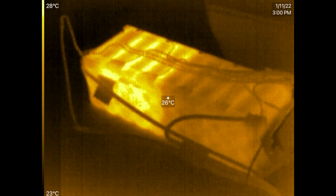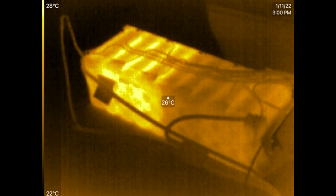You do this on the first try and then the second and third, and if the heat starts dissipating throughout the entire pack, then maybe it fixed itself. But if this continues to happen cycle after cycle, then you have a pack that might be compromised. So this is how you minimize the risk — you just don't keep charging it fully like this. Right now I'm pushing like five amps in there, which is quite a bit — that's probably about the max the BMS will allow. Let's leave it there, come back in five minutes and see where we're at.